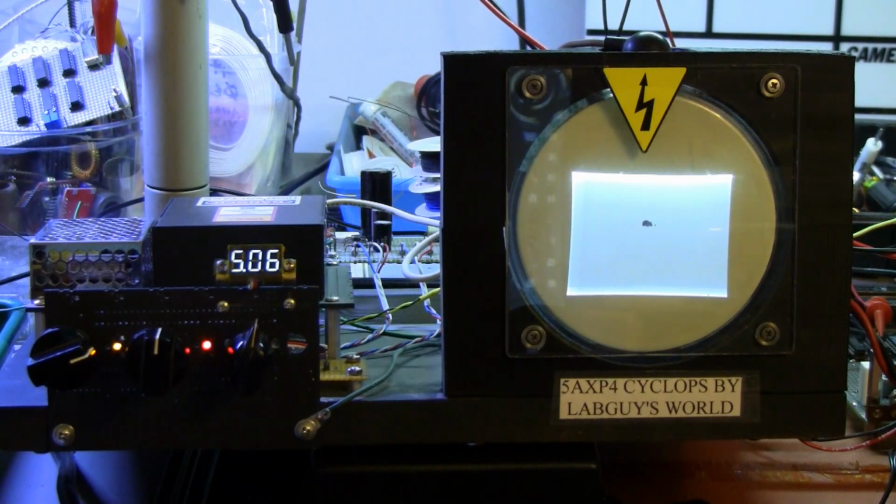It is indeed much better looking because we aren't seeing the loopy ends of the lines. It's been cropped out by the blanking signal. So the blanking signal has chopped that lumpy shaped raster that we had before into a much better rectangular structure. I will demonstrate this by unplugging the blanking signal and plugging it in and unplugging it, and you will see the retrace lines appear, because right now during retrace the beam is cut off and we have this beautiful smooth raster of only active scan lines.